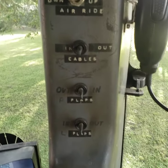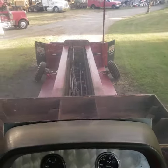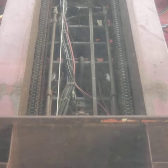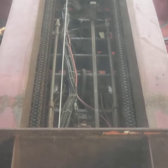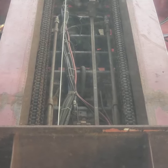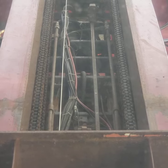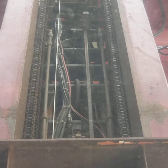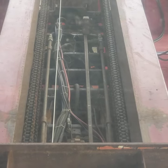There's a switch for the cables — that is the axle cable rack down in there. They are all the way back right now; their tension is off for transport. Switch it the right way and you can see it pulling the rack forward, pulling those cables tight. That's for the airbags being deflated for pulling — it holds the axles up tight to the frame rails to lift everything up when the box tops and the push-down goes off.